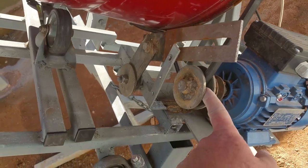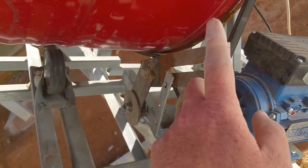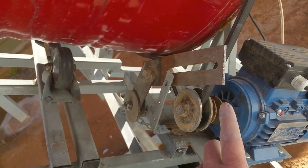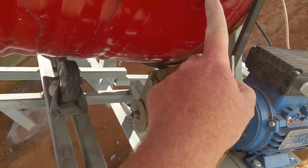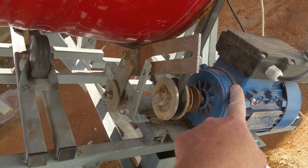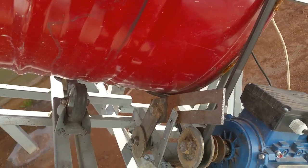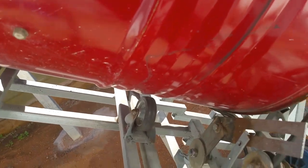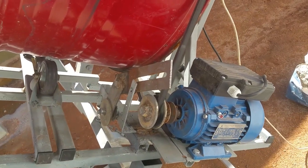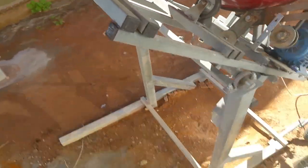I had to make my own pulley. The pulley I bought is 24 mil diameter. To get 27 RPM out of the barrel I have to use a 14 mil size pulley on the barrel, which is 560 mil. The motor is pulling 1300 RPM, which gives me 27 RPM out of the barrel. I've tried it up around 50 RPM and it's just really uncontrollable — the barrel is all over the place and almost falls over. So anything higher than about 35 RPM you're going to have a lot of trouble with the dimensions I've built this at. Just keep that in mind when building it.